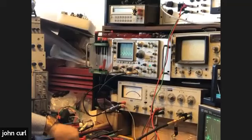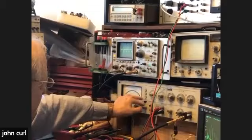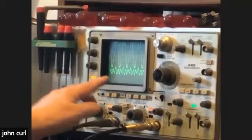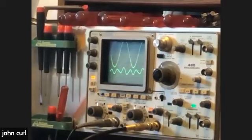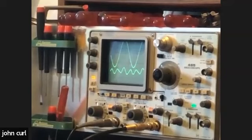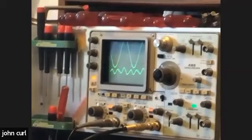And then I'm going to look at the distortion. The distortion is way off scale. So I have to click these sensitivity scales. And this shows me the distortion. And then we see what the amount actually is, and in this case, it's a lot. This is about 10 watts out. It's maybe 10, 12, 15 watts out. Not much, but loud by comparison, and it's getting close to the limits of the amplifier. The amplifier is only like 30 or 35 watts.